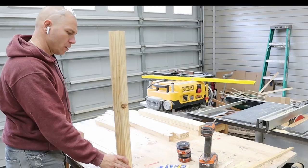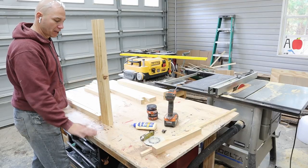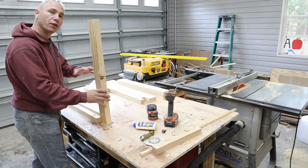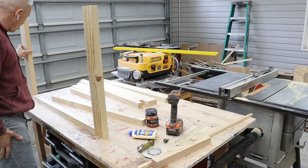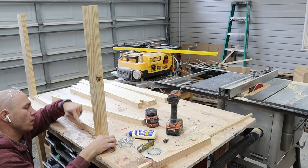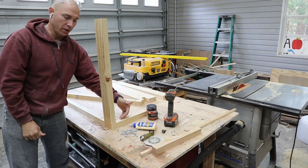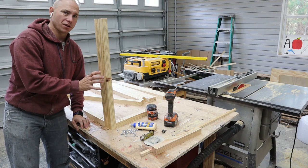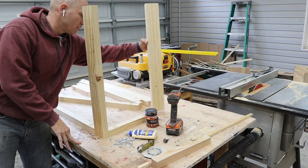What we're going to do is go ahead and assemble everything. You need a nice flat area to assemble this on. If you don't have that, find it — because if you don't have a flat area, one of these legs will end up lower than the other and when you turn it over, you're going to have a big wobble. I'm going to take a little bit of glue in each one of these joints. I'm using two and a half inch pocket hole screws, but when I drill into this piece here I like to use two inch screws — I don't want it to bust through the side, which can happen if you overdrive it especially with this soft wood. With the glue and the two inch screws, it's plenty to hold it.